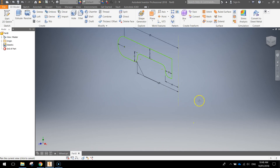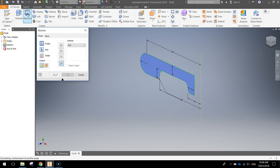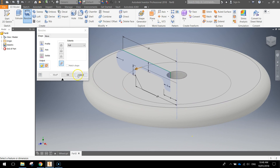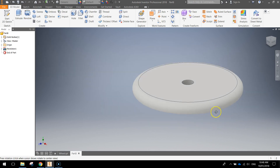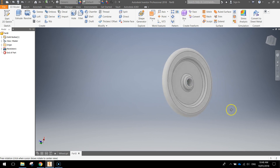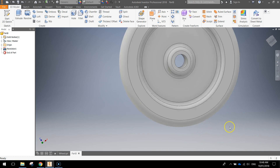That's our final shape for this sketch. Click finish sketch at the top. To get this looking like a wheel, all we need to do is go to revolve. When we select revolve, choose axis and choose the construction line — we're going to revolve this shape around that construction line. When we do, you can start to see a wheel appear. Click OK when you're done. Flip it around and you'll see we've got the start of our wheel. That's looking pretty good.